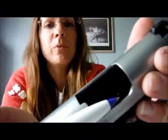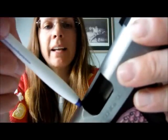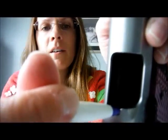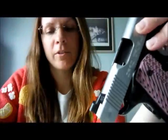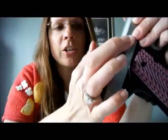The feed ramp is right here. Your bolt face is this back flat area here. And right here, this little hook area is your extractor — that's what grabs the edge of the casing and pulls it out of the chamber when the slide is moved into the rearward position. As it's bringing it back out of the chamber, the back side of the cartridge strikes this little post here, which is your ejector. As the edge of the casing hits the ejector, it causes it to fly out in the opposite direction — toward the right. That's why your casings fly out that direction and why your ejection port is cut out on that side.